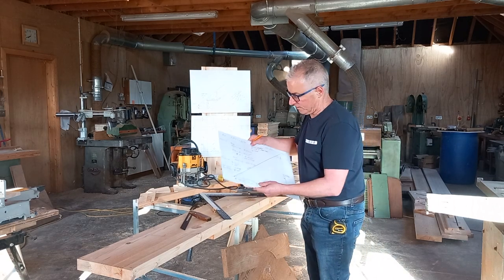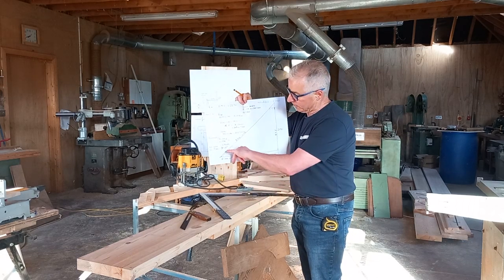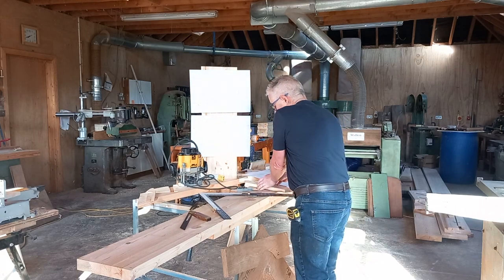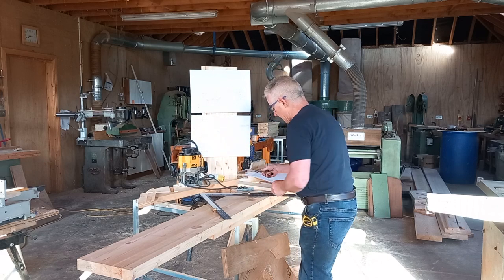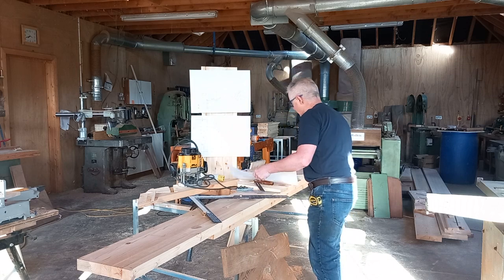Now, we're back at the stage where we want to mark out the string, and this is how we go about it. We pick up the pitch angle again, which we mentioned earlier on. We bring that into play again, a very important angle, so I keep that ready at all times. Once I have the pitch angle, I need to take account of what's called the margin line.